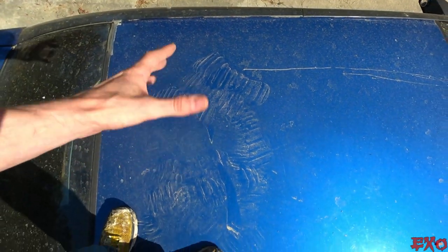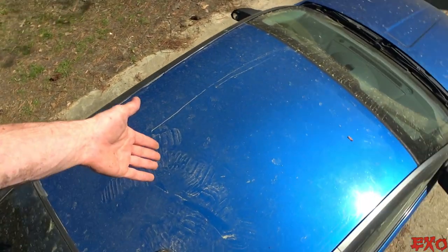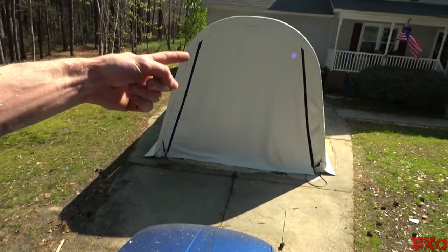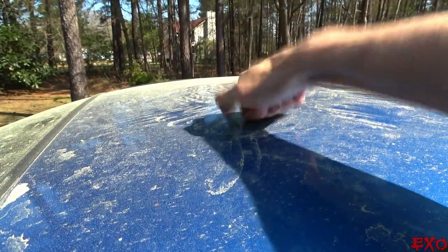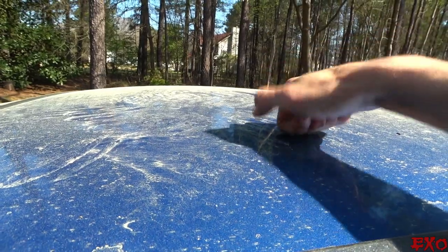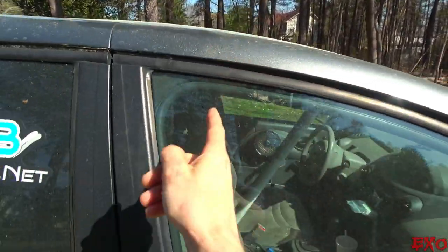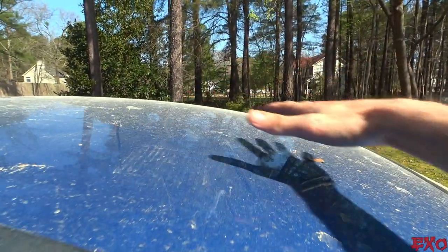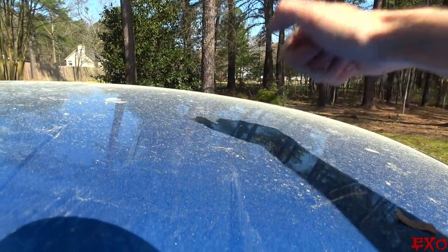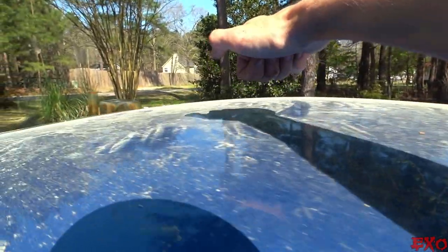If you'd like to know how I did that, I have a whole build video on this as well, but I'm gonna be doing the same method we applied on Little Blue inside the Behemoth build. There's not a single sheet of deadener on this roof, but yet it is completely dead, and the sound deadener begins inside the cabin of the vehicle, which starts at the B pillar. This is deadener. See, there's a difference. It has a little more resonance, doesn't it?